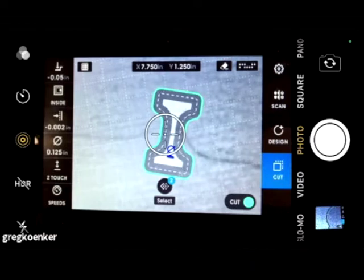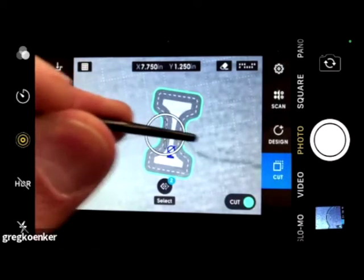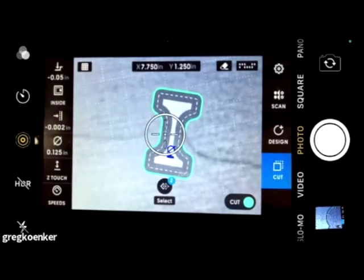So it enlarges it, but I'm not enlarging it by just 2 thousandths because it's an enclosed space. So it's doing it on both sides. So you're really getting 4 thousandths of an inch. It's cutting 2 thousandths further out over here, but it's also cutting 2 thousandths further out over there. So all the way around, it's 2 thousandths bigger. So you're getting a 4 thousandths overall enlarged pocket. So you do that real quick, and it doesn't take long because you're not cutting any real stock. You're just trimming the edge.